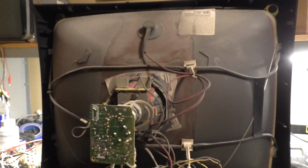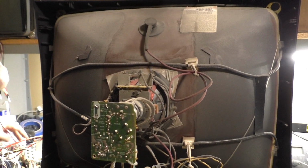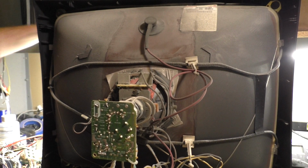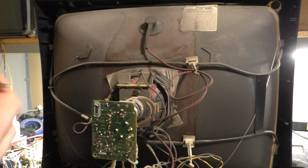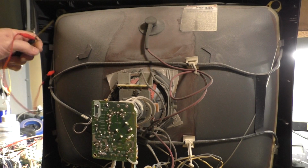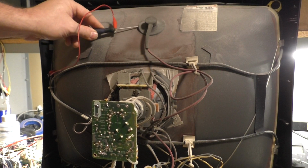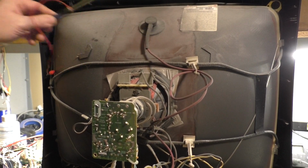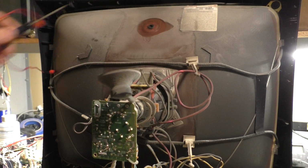So I don't know if this is auto discharging. So just to be on the safe side, we're going to discharge it. All right, let's grab an alligator clip with a screwdriver, clip that on there, clip this onto the ground right here, and then let's just, whoa, it is not auto discharging. Glad I tested it. Snap city. So let's get this off of here and make sure one more time so we're clear, good to go.